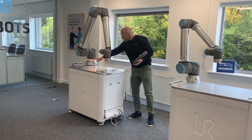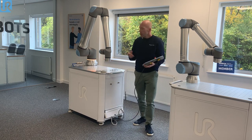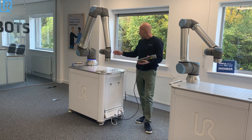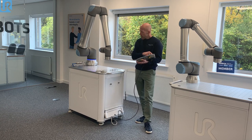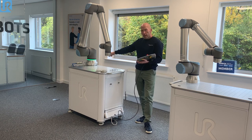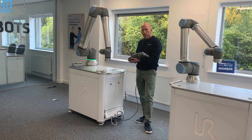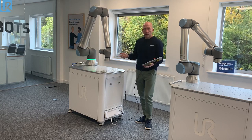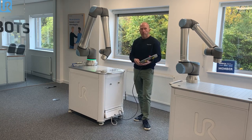We actually have a status ring on the robot that gives us an indication of what mode the robot is in. When I press the teach pendant it goes blue, so it's now in manual mode and I can move the robot. If I come out of that and go into automatic, the status turns to green, so now it's in automatic mode and when I press play it goes back to the beginning of my program. It's really nice that we can see from a distance what particular mode the robot is in.